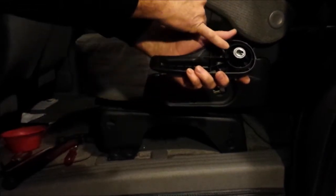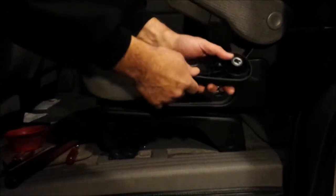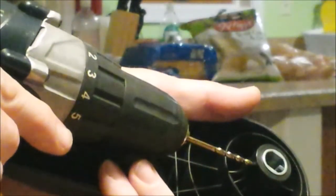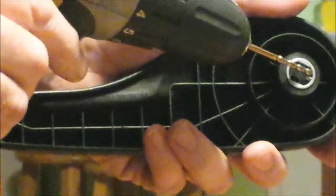So I'm going to drill a hole here and put a pop rivet in there, then hammer it back on and screw it back on and it's going to work. I'm going to take this drill and I want to drill it high so I can get my pop rivet tool into the space I need. I'm going to try to get it directly across from that pin.